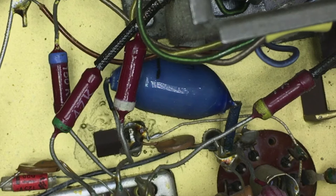There's not that much space to work on. There are quite a few components connected to that pin, and so getting it out without damaging anything or without shorting anything is actually quite a challenge. So what these guys came up with years ago was a technique where you actually cut the pins off.